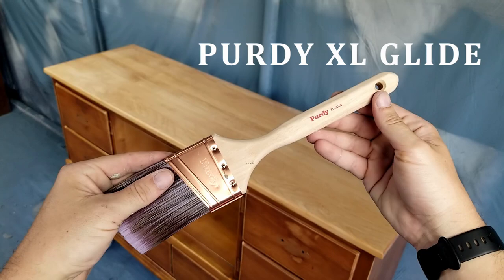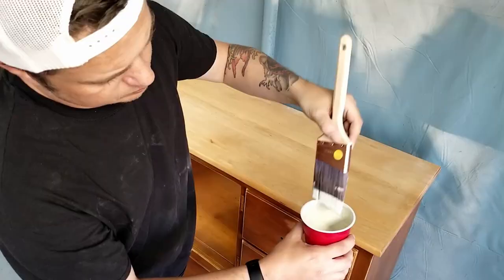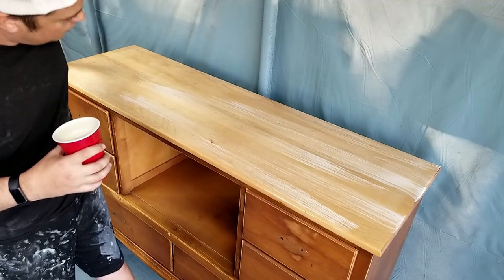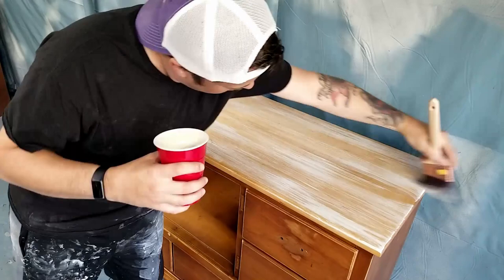To apply the paint for this project I'm going to be using a Purdy XL Glide Synthetic Brush. For the paint I'm going to be using Valspar Signature in a satin finish — this color is called Mystique. I'll be dry brushing this piece, so I only want to get a little bit of paint on the tip of my brush and then wipe most of that off before applying long light strokes on the surface. I'm not trying to get full coverage because I'm going to be layering several different colors to get a rustic farmhouse looking effect. My original plans were to dry brush this piece white but the orange tone of the wood wasn't going to work well, so instead I'm going to be using brown and gray along with the white to hide that and make it look like this white is painted over a darker wood.